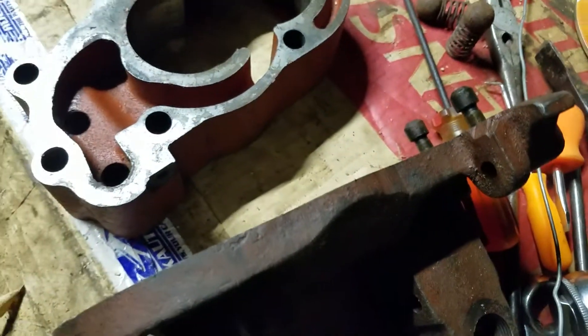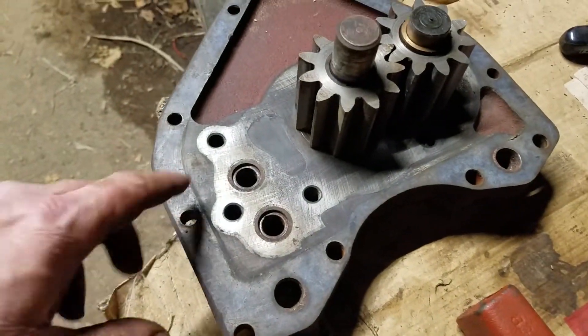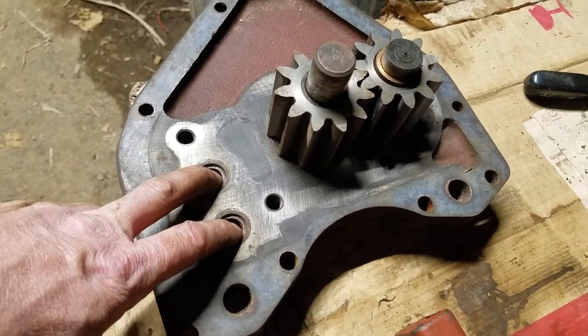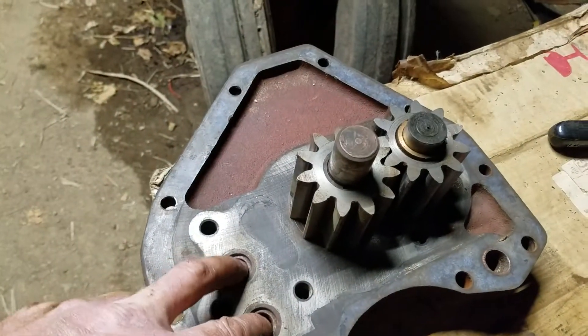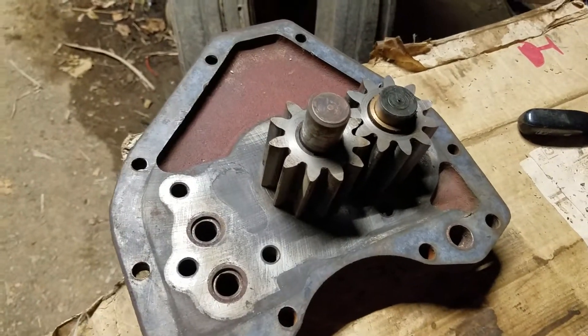So that's basically how the system works. If you're leaking while your lever's supposed to just be holding oil in the cylinder, it's these check valves — check balls would be the place to check. If you can't get it to go back down again, probably these pins are broken. If you can't get it to stay up at all, maybe the spring's broken here, and the check ball's not coming back up against the seat.